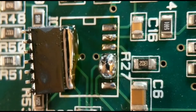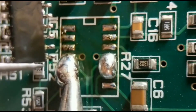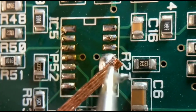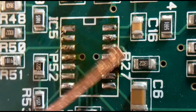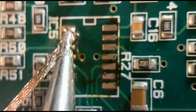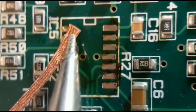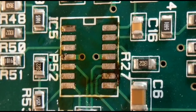Hold the iron on each side, grab the IC body with tweezers, remelt the second side, and just take it away. Afterwards you can go along with wick and remove the excess solder. This is a really safe option for two-sided ICs. A second iron is also great for taking off resistors, tantalums, and all sorts of bigger two-sided components — I'll probably do a video on the uses of two irons one day. There you go — a lovely clean board with no damage. That's definitely my preferred option.